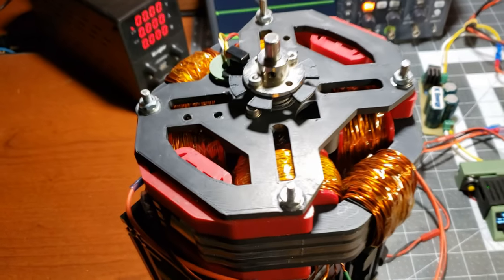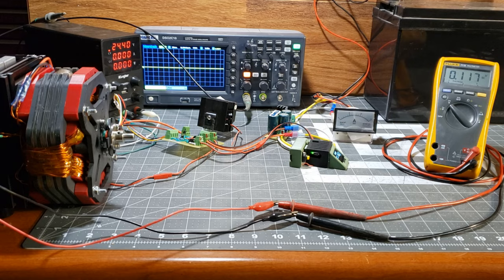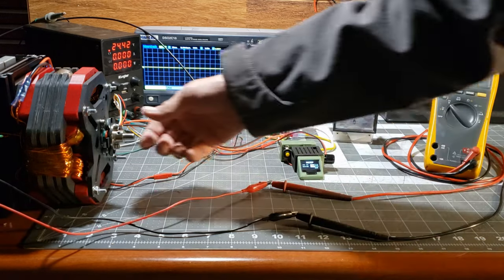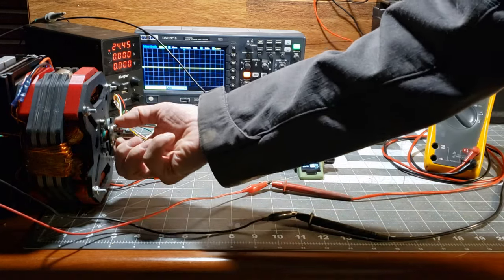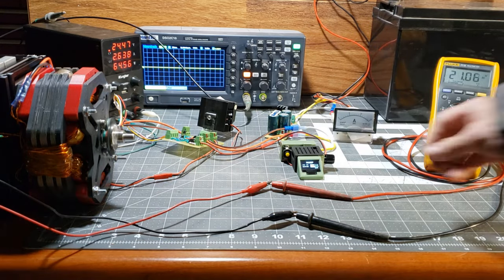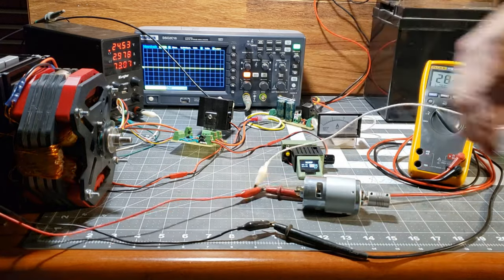I've made some modifications since my last video. This opti-timing disc controls the DC motor with the aid of a pulse width modulator and a capacitor dump to extract flyback spikes from the DC motor. I've rewound my coils with fewer turns of bifilar wire, which consists of 2 wires twisted together and connected in parallel to generate more amps.